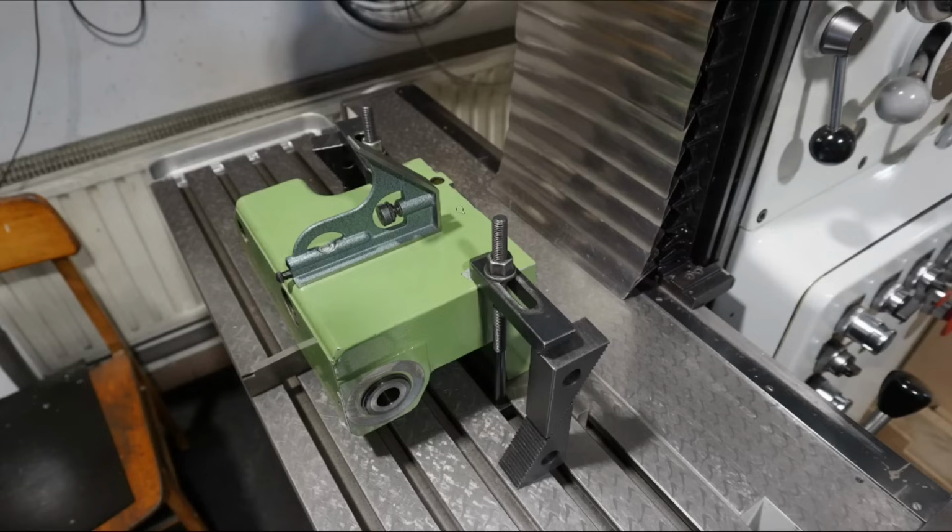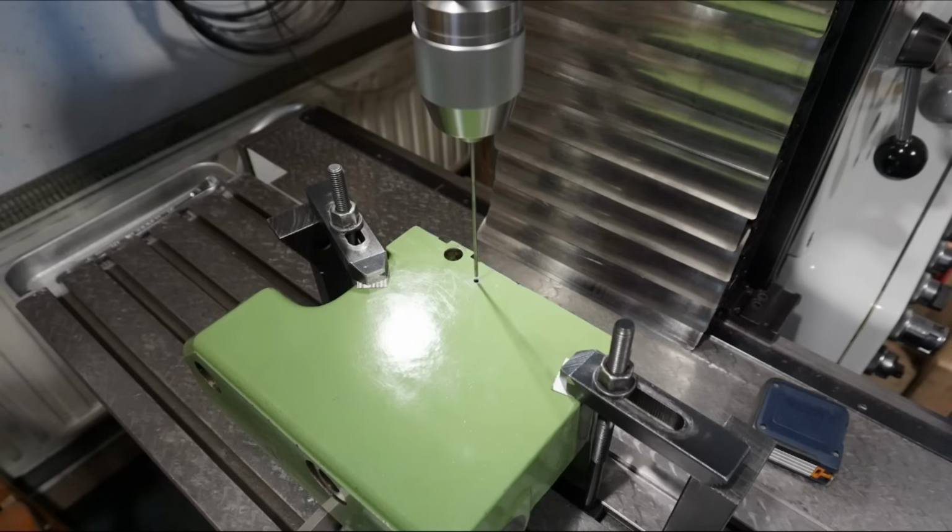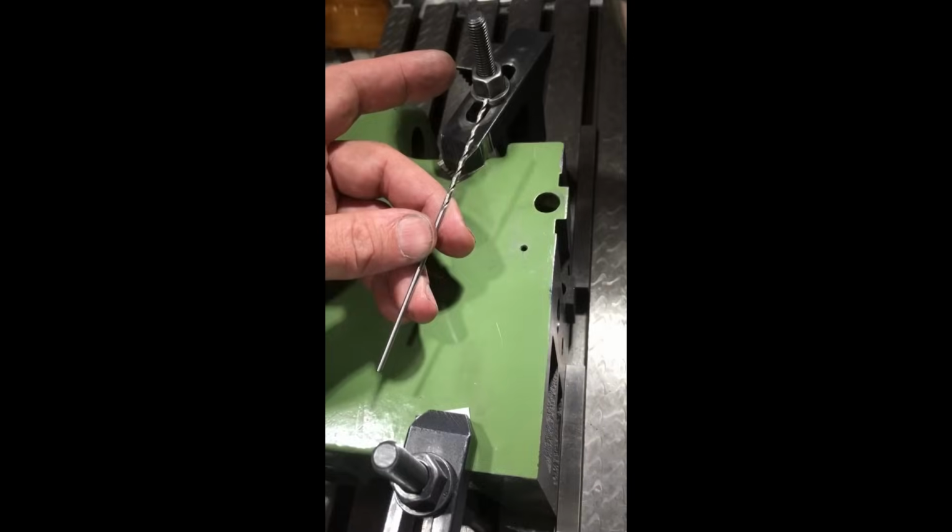Also, I wanted the lubrication system to keep functioning regardless if I had the tailstock adjusted for taper turning all the way to the end stops, of course. So that required machining of oil transfer pockets on the bottom of this casting here to transfer oil from this piece to the bottom piece. And you see, this is conventional deep hole drilling, really unspectacular in comparison to the bed slide, but still, this is conventional.